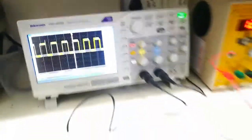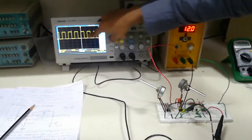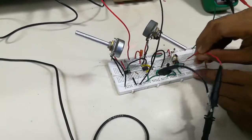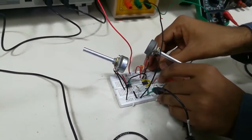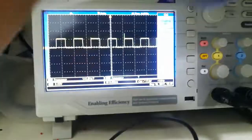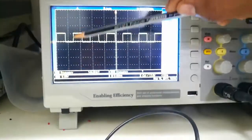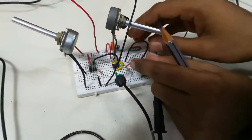The most important thing is that you have to maintain the output voltage at 5 volts at the transmitter. Let's check — as we maintained in our telemetry circuit — here you can see it is maintained at 5 volts: 5 volts per division, so one division multiplied by 5 gives 5 volts.